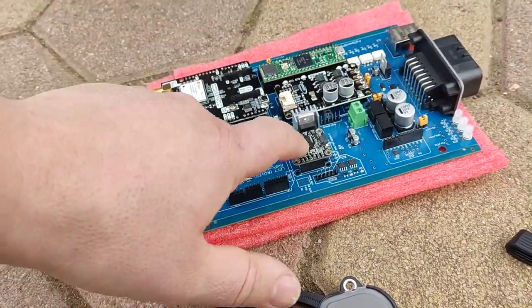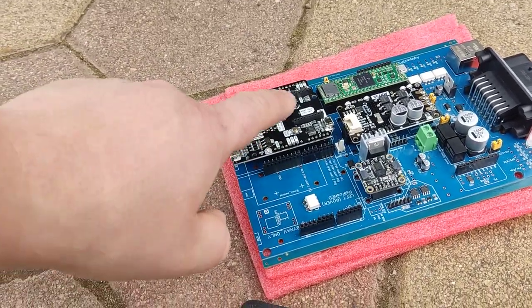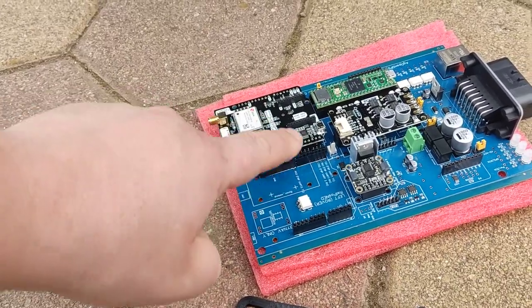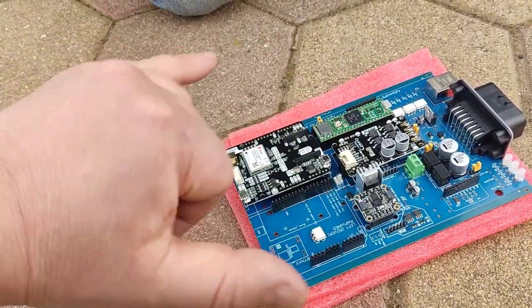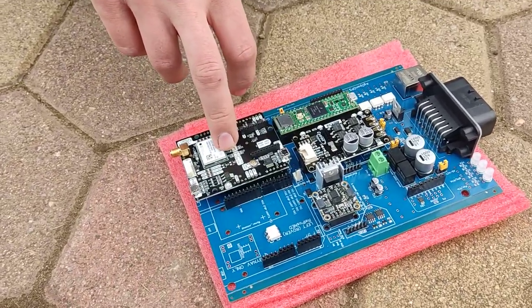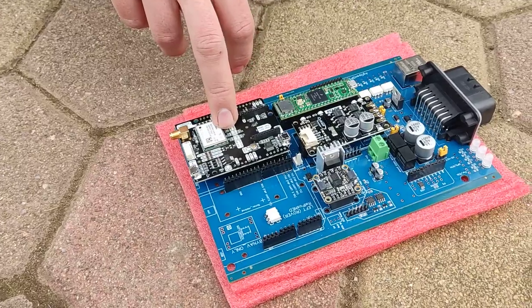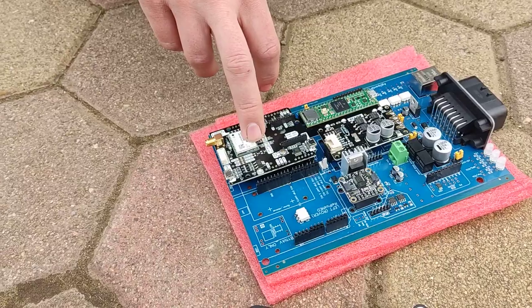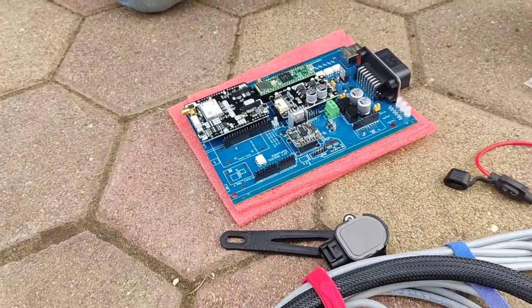This is how we are moving and the GPS tells us where we are exactly — centimeter size. If you have two of them, two RTK GPS, then from the difference you will know exactly how you are moving as well. A little known fact: this GPS can actually do millimeter precision. We are only using centimeter precision, but this GPS can do millimeter precision, which is way overkill for our application.